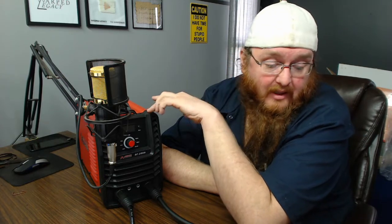A lot of these little cheap inverter welders will not run E6010 rods because they don't have high enough open-circuit voltage. According to the spec sheet, the open-circuit voltage on this thing is 85 volts, so it is supposed to be able to run E6010. But as with all the other numbers I've been stating, I don't know how accurate that paperwork is.